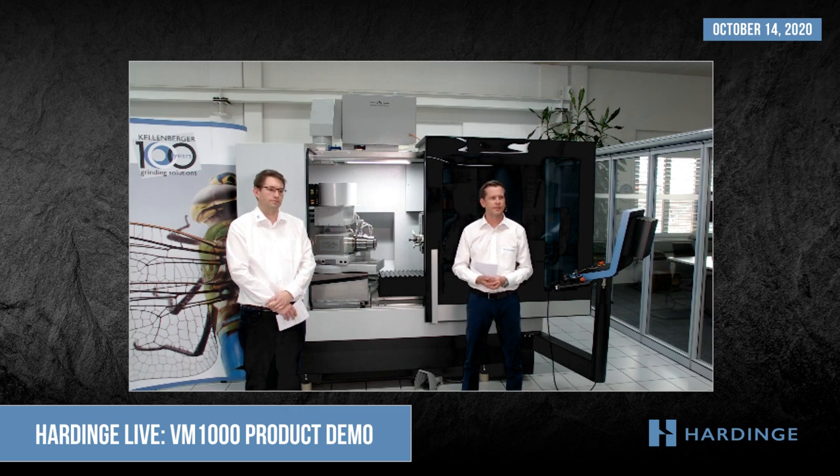Okay. Michael, what is the difference to the VOUMARD 150? The VOUMARD 150 is the elder machine generation, and it has a completely different machine structure. It is also designed for longer parts. For example, to the base differences, it has a crossed axis and no hydrostatic. On the other hand side, the VOUMARD 1000 has a better precision level, in summary.